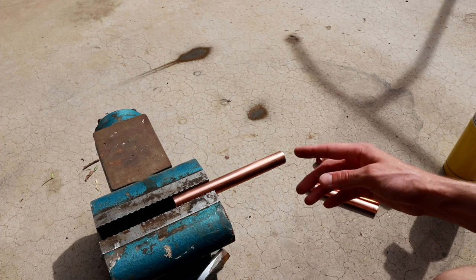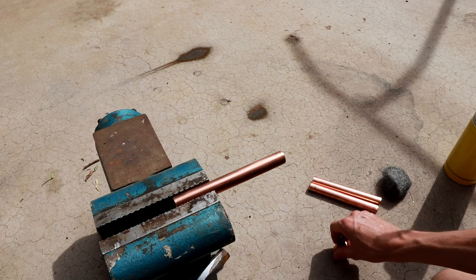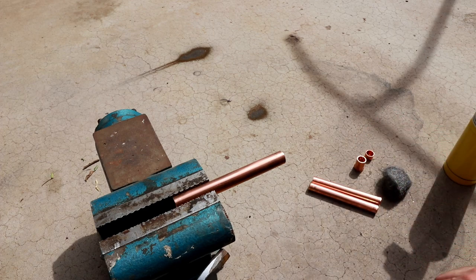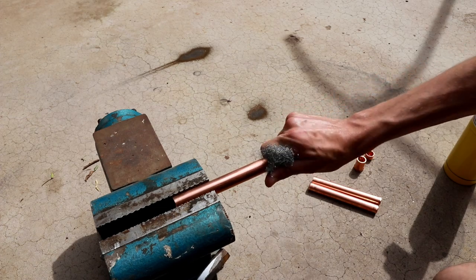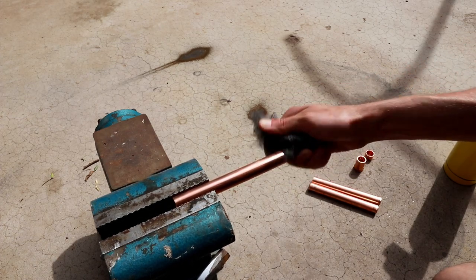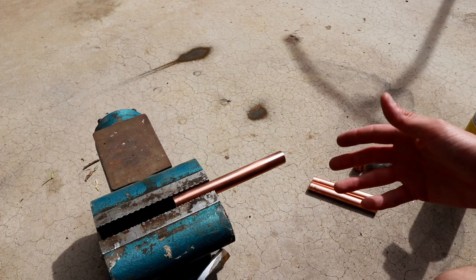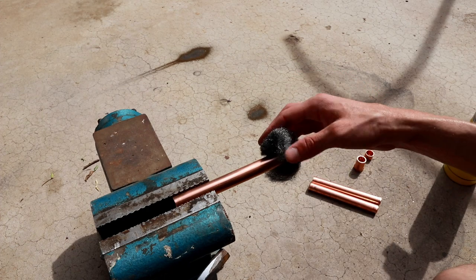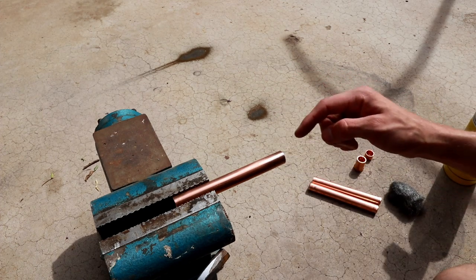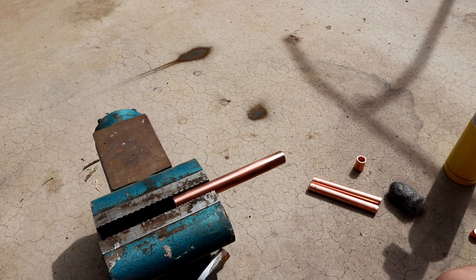I have a couple pieces of copper pipe cut to length for testing. I'm going to be brazing some caps and threaded adapters onto these pipes so that I can pressure test them with an air compressor. I'm going to start off with some steel wool to clean the end of my line and scrape off that oxide layer on the outside. For an HVAC application you'd also want to ream out the inside, but for our qualitative pressure testing that's not necessary. We do still need to take the oxide layer off for optimum wetting.